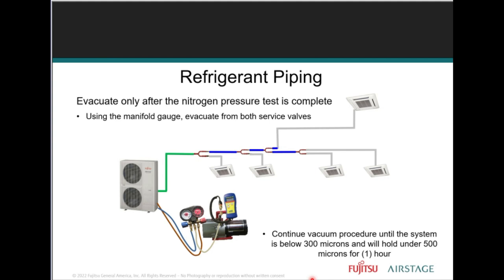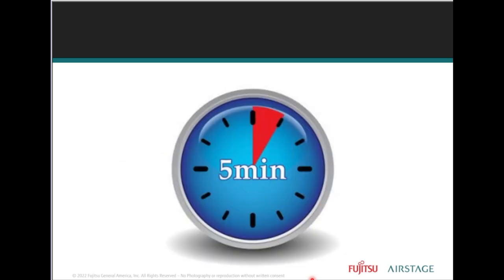Right. So when the pressure test has been successful and nitrogen released from the system, vacuum pump, clean pump oil, and proceed with your industry vacuum procedures. Very simple. Industry practice, right? 600 pounds of holding charge, 24 hours, no leaks. And then make sure your vacuum pump will hold a level of anywhere from 300 to 500 microns. You can go down as low as 300 microns, but not go above 500. Right? Just industry practice.